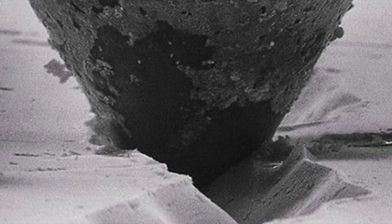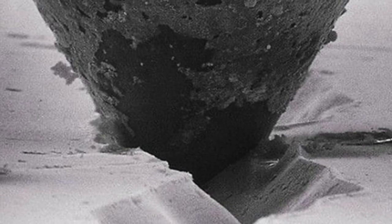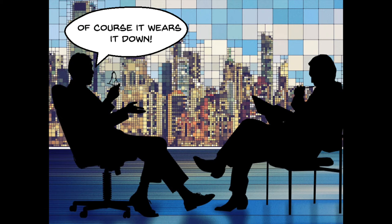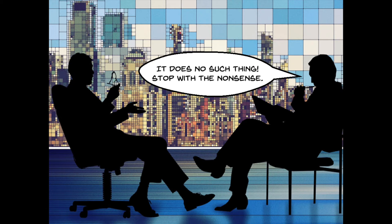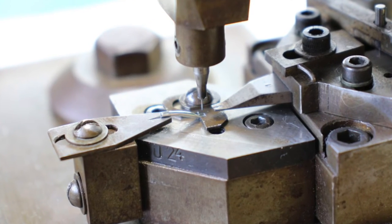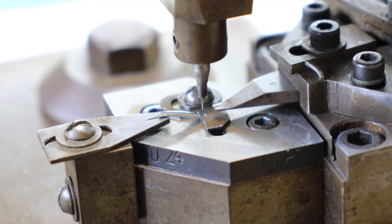But it also misses out on some of the information embedded deeper in the groove, such as some of the higher frequency representations of the music. And it's worth mentioning, there is quite a bit of debate as to whether or not this produces more wear on the record — the jury is still out on that, and it really has been for decades. Spherical styli also happen to be the most common and the less expensive to make.